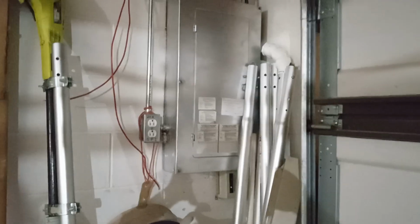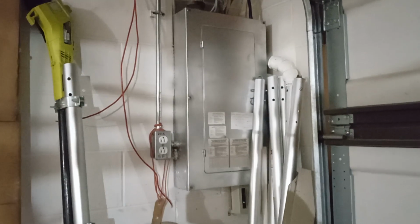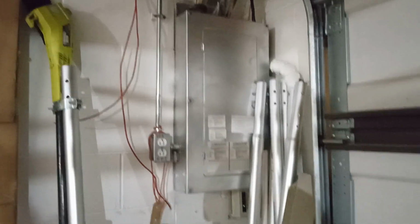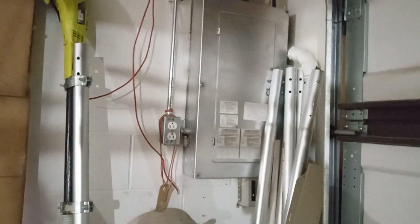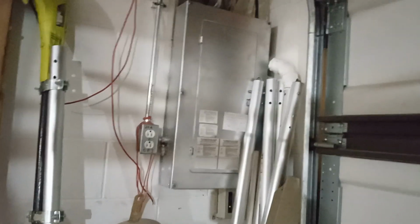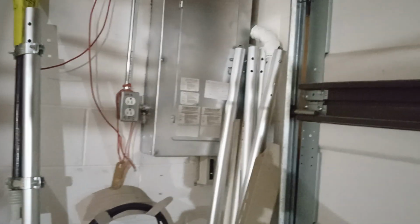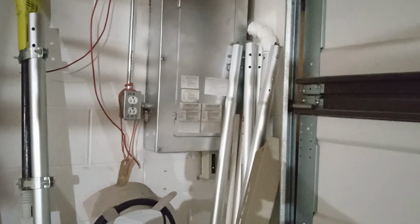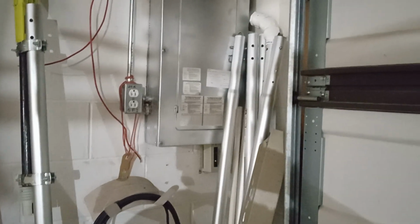But to continue this idea of grounding, at the prompting of John, who mentions ham station grounding, what you need to understand about grounding is there's no such thing as grounding ham equipment. It doesn't exist. And the fantasy there is that we need separate ground rods for grounding separate things, and that's completely contrary to code. What ground rods are for is for grounding the service entrance.